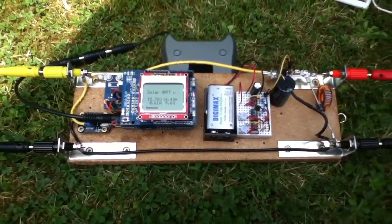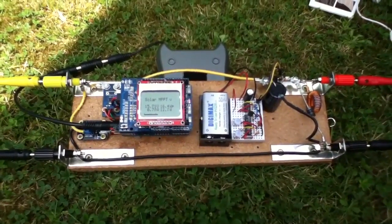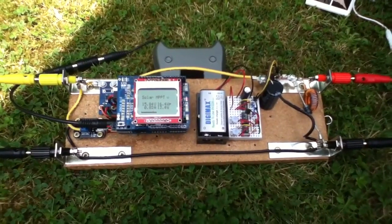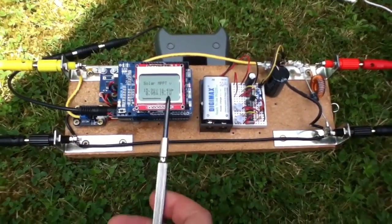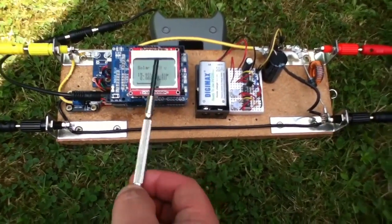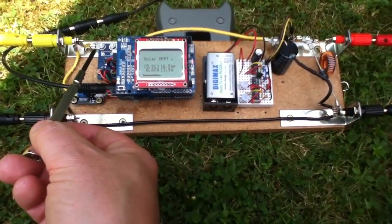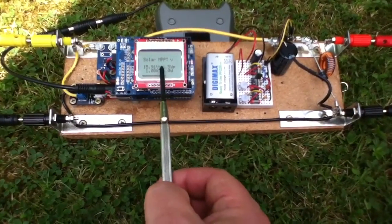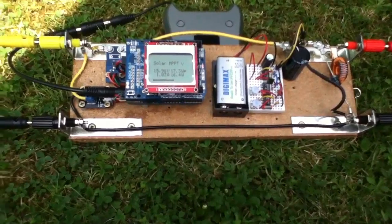I just wanted to do a little recap on the solar MPPT test rig. I've laid things out in a slightly different order on the board now to make it a bit easier to understand what's going on. This section here is just a computer and all it's doing is measuring voltage on this sensor and current on this sensor up here. I'm multiplying them together to give watts, and then there's a watts peak figure which just records the maximum value that this ever yields.